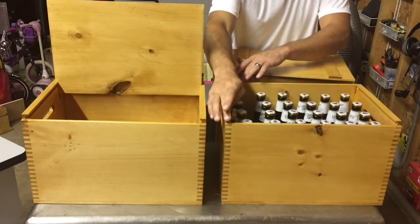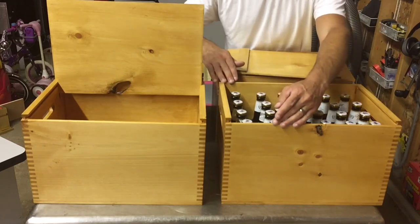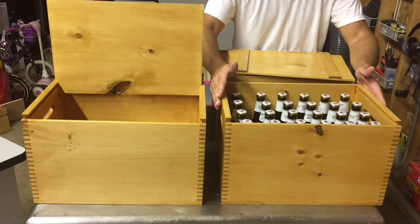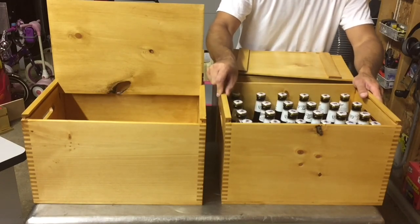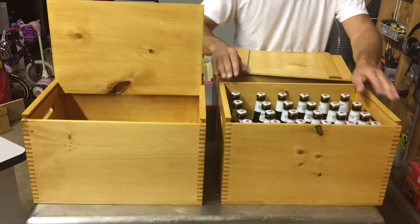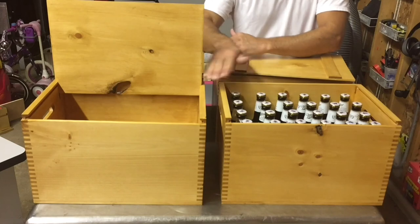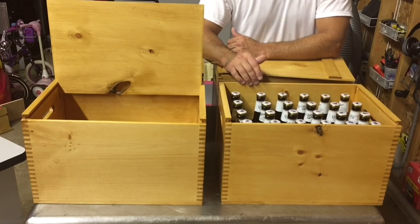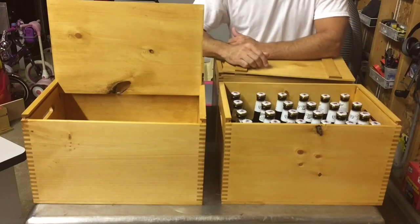It's just about 11 inches wide — maybe a little bit wider because the boards are 11¼ inches from Home Depot. It is 17½ inches long, and it's a ¼ inch thick here and ½ inch thick here. Eventually I realized I should go a little bit over a ¼ and a little bit over ½ inch, so I started playing with different thicknesses over those tolerances. I believe the originals were a quarter and a half, so I've tried to stay as close to that as I could.